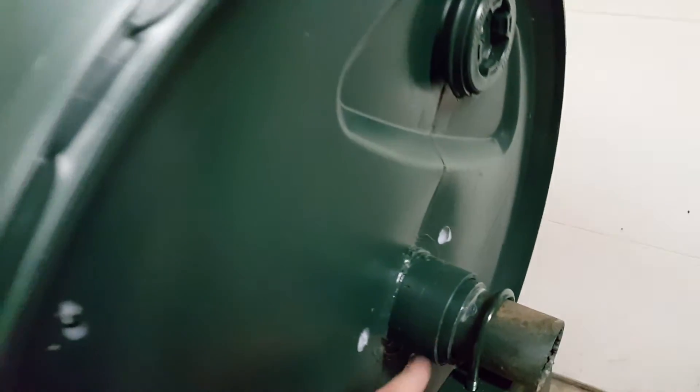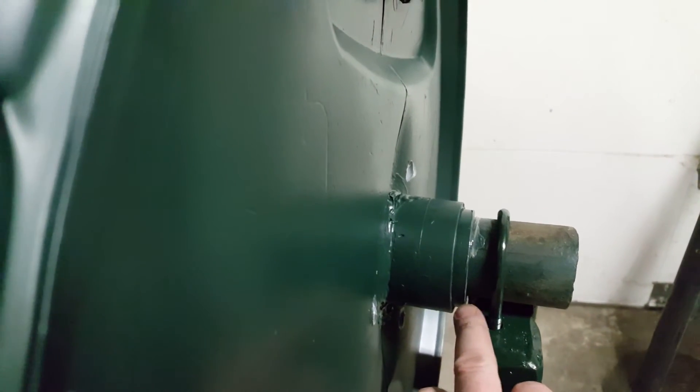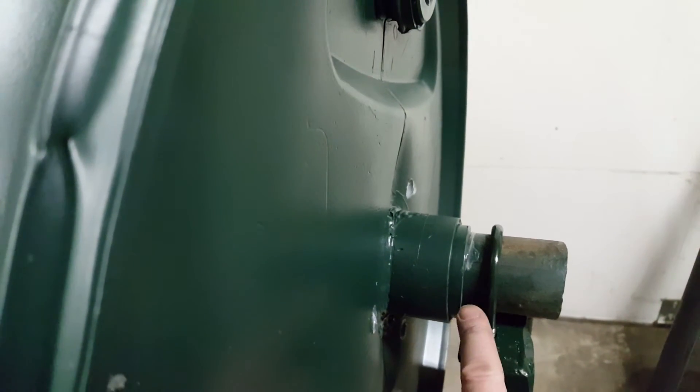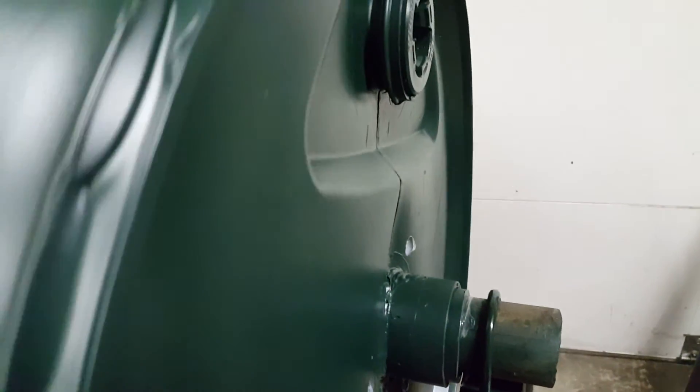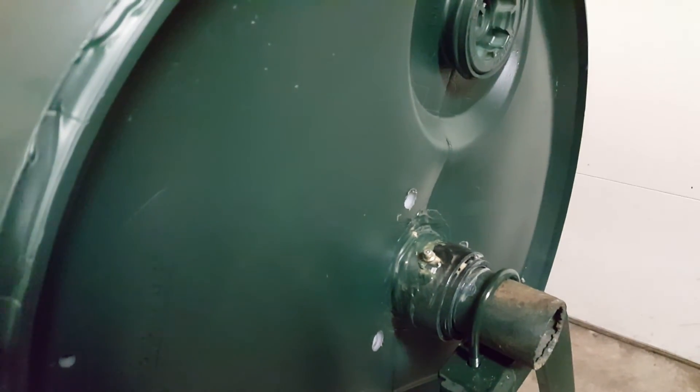I cut a little piece here and use it as a wear bar. There's not much of a gap, and if it does wobble a little bit it'll still spin. At the very center of that coupler, I drilled and put a grease nipple so that you can add grease as it wears or washes away. I used synthetic grease and coated it all over the pipe before installing it — it's very well greased and spins very well.